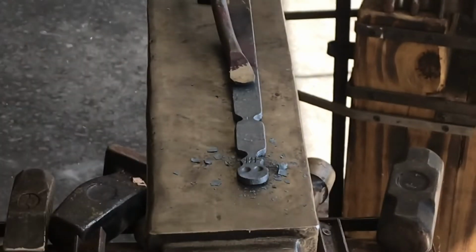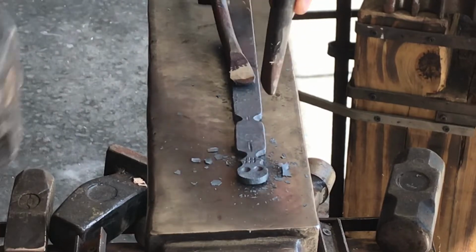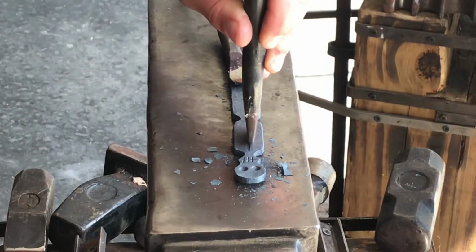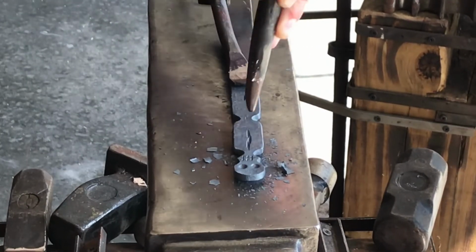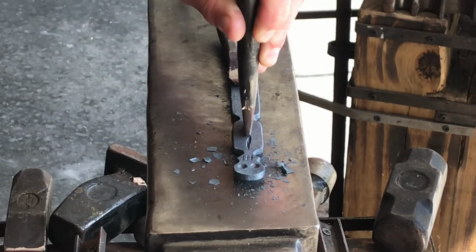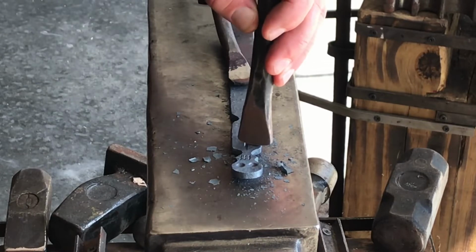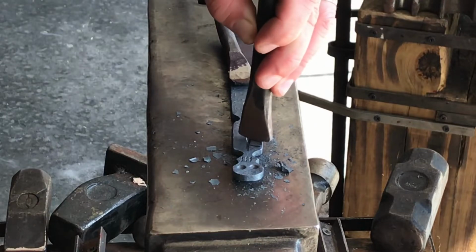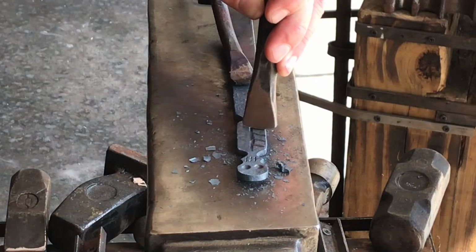Now I have a fuller style, very blunt chisel that I made from some spring steel. Works great. I have the rounded edge because you can walk it down a line that you want to mark. You can see here I'm getting a little cattywampus with it, but that's all right. I'm just marking out where everything goes. In the next heat, I'm going to actually deepen everything, and it'll clean up some of those spots that aren't exactly even.